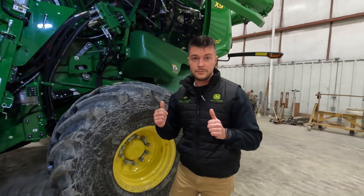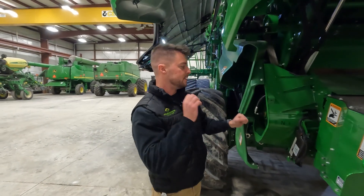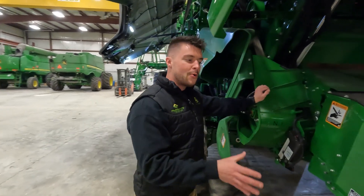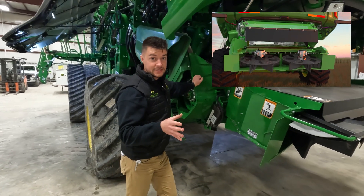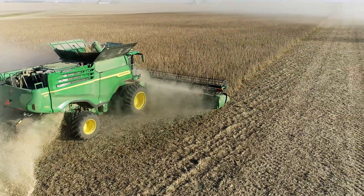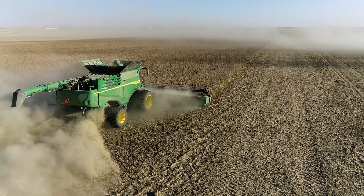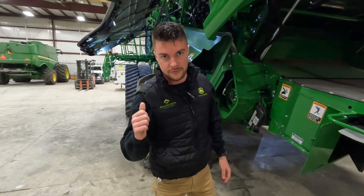So if you're an organic grower or a food grade grower, this is your machine — keeps it nice and clean. For residue management, on the back of the machine we have our deluxe power cast tailboard, belt driven — different from our S Series, which were hydraulically driven orbital motors. Again, more efficient power consumption, and it allows us to really spin this thing fast enough to throw our chaff out to cover 50 foot swaths if we have a 50 foot hinged flex draper on the front. We also have our in-cab knife bank adjustment motor, so we can make changes on the go by pushing buttons in the cab — no need to get out and mechanically move a lever.